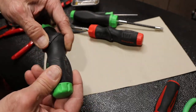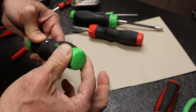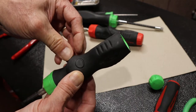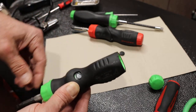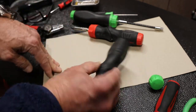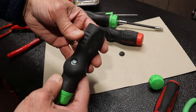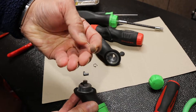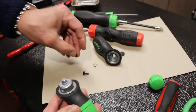Starting out with the handle — there's a spring-loaded lever inside that locks into position and holds the handle. I'm going to pop the cap off, and on the backside is a little access port. Pop that open using a fingernail or whatever — there's a retaining ring that you can use snap ring pliers for. Just go in, pop that free. I've already done it just to speed this up, so you can pop out the snap ring and then carefully slide these two apart.